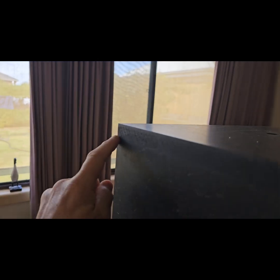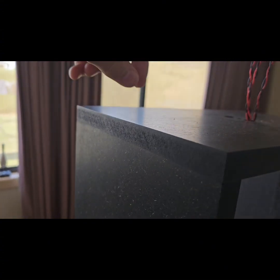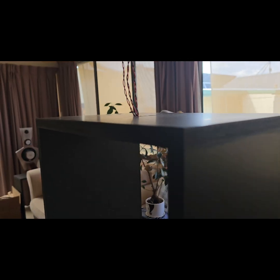Here's the bridge. It was a pretty basic arrangement. In the join through here there were three routed out sections with biscuits glued into three positions, and then routed out sections in the top part that this sat into — the same on both sides. Again, three routed sections where biscuits went through, secured with a constructive adhesive with a urethane situation.